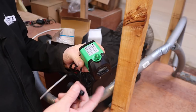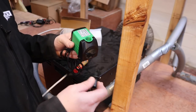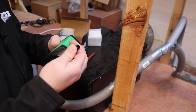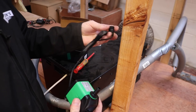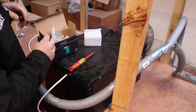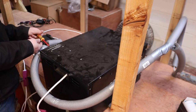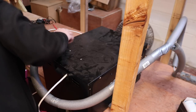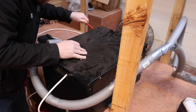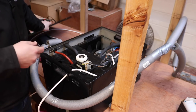All we're going to do is basically hardwire this little thing into the chiller in replacement of the recirculation pump that's already in there. The recirculation pump isn't really going to be pumping more than about four foot above its head, and this has got to do a little bit more work than that. So we're going to stick this on, jerry-rig our cooling pipework onto it, stick that in, and wire this up into exactly the same place as the internal pump was wired up. Fortunately the internal pumps on these are 240 volt as well, so there shouldn't be a problem with compatibility.